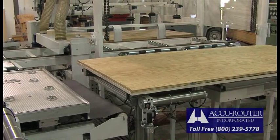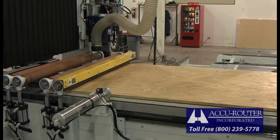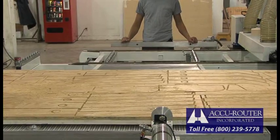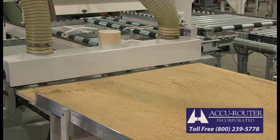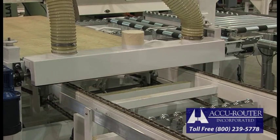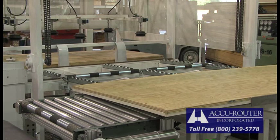The Series 2 HV machine is fully integrated to an AccuRouter automated conveyor system for unmatched panel production capability — up to 400 nested panels machined in one eight-hour shift when stack cutting two panels at a time. This advanced cell requires one operator to unload cut parts and offal; every other cell function is handled automatically through the FANUC CNC control. The automated conveyor system incorporates an automated unload from the machine table, a powered conveyor line, a powered rotary brush clean-off station, a three-baffled dust hood for efficient cleaning of the bleeder panels, a repositioning conveyor section to the queuing station, and a lift-and-place trolley that operates from the plywood bunk to the queuing location.